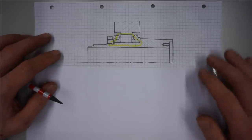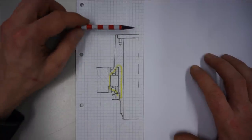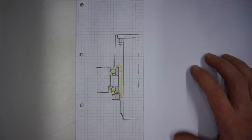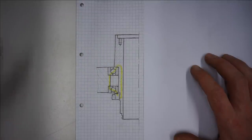But you could say then, why not get the spindle in the vertical position, put 100 kilograms of load on it, snug the nut in the back here gently so the arrangement is free of play, and then remove the 100 kilograms. This constitutes our design case, doesn't it? Right, it does. And this is the perfect solution in theory.